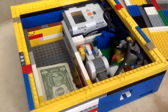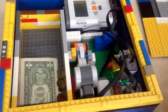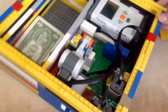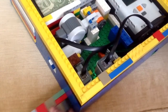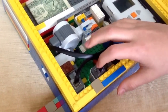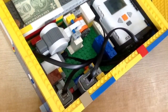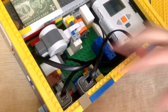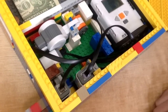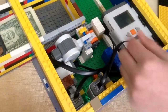You can repair things if needed. When you look in here, what first happens is this touch sensor right here is pressed once you insert the key card. When the key card is inserted, that touch sensor is getting pressed right there. Then this color sensor, which is this one, will actually read the card — which would be the yellow on there. And then this touch sensor again, right here, is going to wait for you to pull the key card back out. So when you pull this back out, it's going to tell you 'Fantastic' and open the drawer, which would be from this motor.